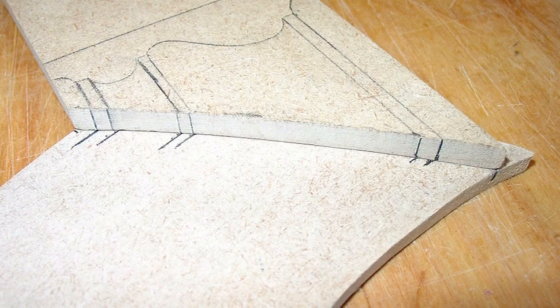That made it easy. Oh, and there they are. So you cut the radius on the first piece? Exactly. So now this is cut, and now you can see that was 1/8 of an inch off when this was cut straight. Now they line up perfectly. Excellent. What a perfect example. Oh, and this is the profile of your molding, so you can see where each of your lines are coming out. We've extended the lines of the profile.